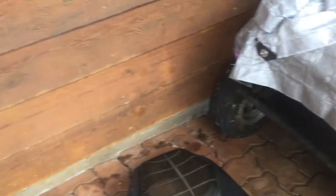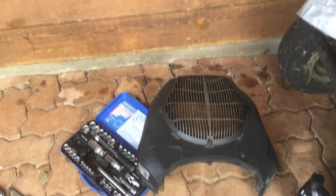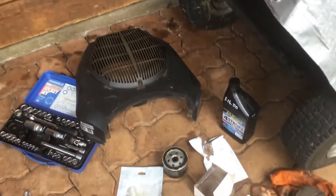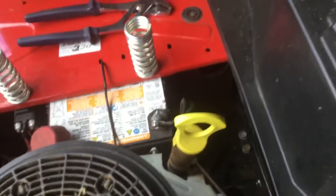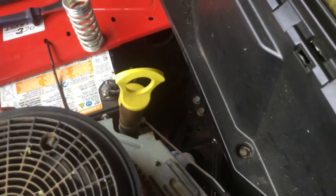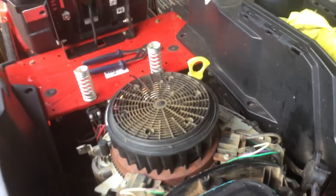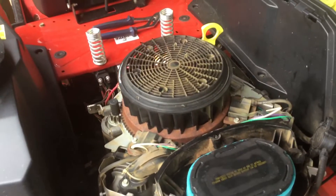There's the Greenfield under cover there — I'll just put the covers over them to keep the sun off them. I've pulled off the cowl — nice heavily made cowl it is too. I've put a new oil filter in it, a new fuel filter in it — you can see it down there and the oil filter is down beside that. I've put 1.8 litres of engine oil in it; I'll level it up and check it when I get it going.